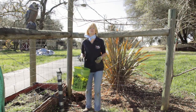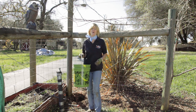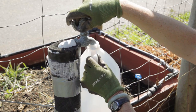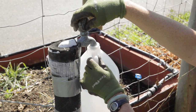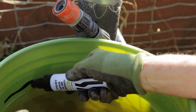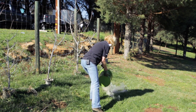To choose the right pressure regulator for your water, we're going to estimate the water flow. We're going to do that with a 5-gallon bucket and a stopwatch. Most 5-gallon buckets actually hold more than 5 gallons, so take something like a gallon jug and pour 5 of them into the bucket. Mark where the water level is, and that's 5 gallons. Throw away the water, and you're ready to fill it back up.